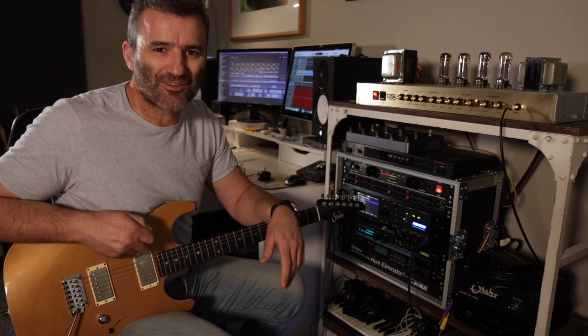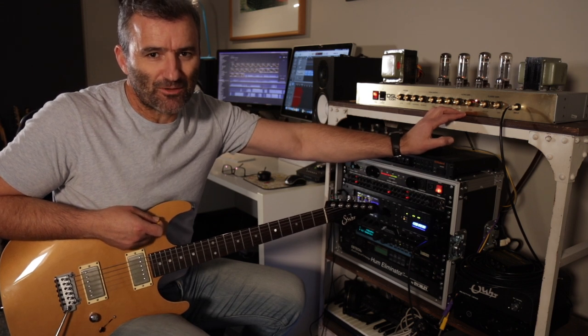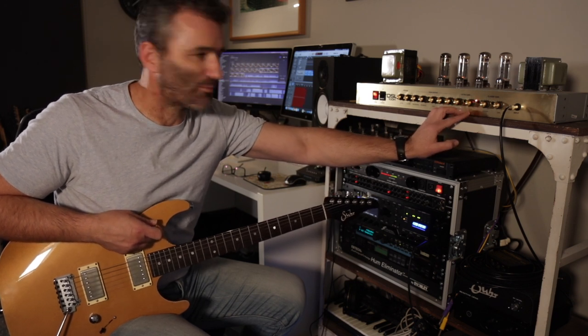So with all that in mind, what I've been doing with my approach to the mods is to try and take some bass out of the early stages of the amp, because it was clearly getting far too woolly and flubby and very much out of control. Also, too much gain. The gain just stacks in this thing and becomes uncontrollable, which I think is contributing a lot to the lack of clarity in the stock amp. When I first received it, I could not get this gain pot above midday without the thing just becoming complete mush.